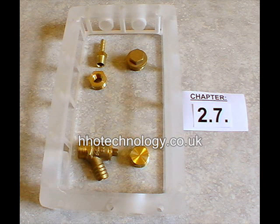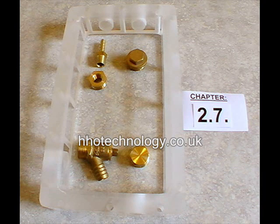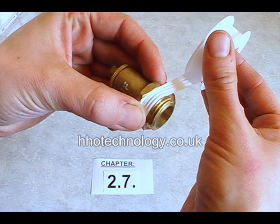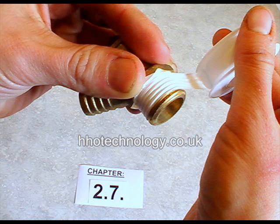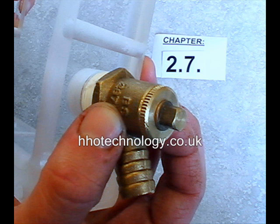Fit the brass fittings to the fluid reservoir. The threads tapped into the reservoir are half-inch, which are compatible with many 15mm brass compression fittings. The fittings supplied are for a default set-up, but you can buy many different types of compatible fittings. Use the Teflon tape to seal these connections — take a brass fitting and wind 10 turns of Teflon tape clockwise tightly onto the brass thread. Cut off the Teflon spool and carefully screw the brass fitting into the fluid reservoir. Take care not to cross-thread; it will go in easily if it goes into the thread correctly. The threads in the acrylic fluid reservoir are quite brittle, so take care not to break them by screwing anything in wrongly.